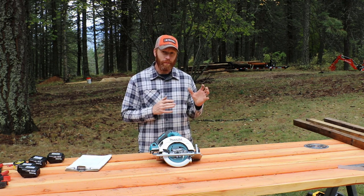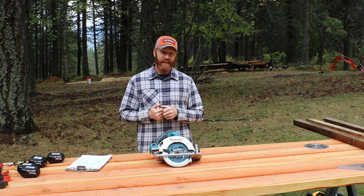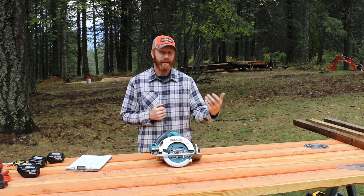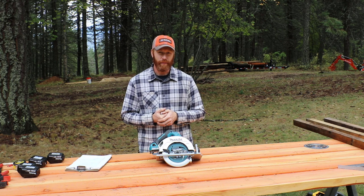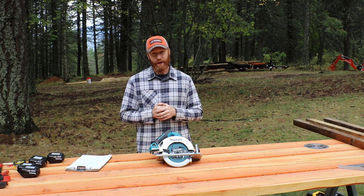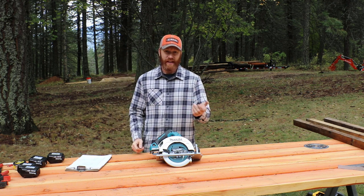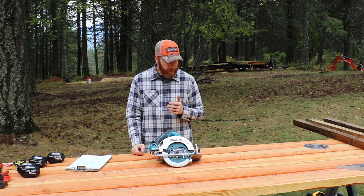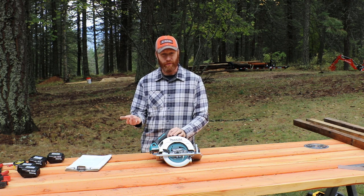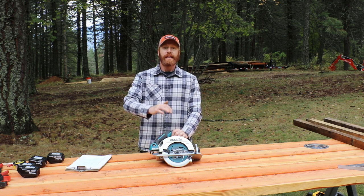There are multiple different brands out there, whether it's DeWalt with their 60 volt max. If you're running it in a tool that's designed for 18 volts, you're actually getting really good amp hours. You might get that 12 amp hours or 9 amp hours, whatever the battery's rated for, but you start getting it into a 60 volt tool, divide those amp hours by 3, and that's what you're actually running at. So you might only be running at 4 amp hours in a 60 volt max tool. But because it is two separate batteries and they're both rated for whatever amp hour they're rated for, you get a true 36 volt 5 amp hour tool out of this.